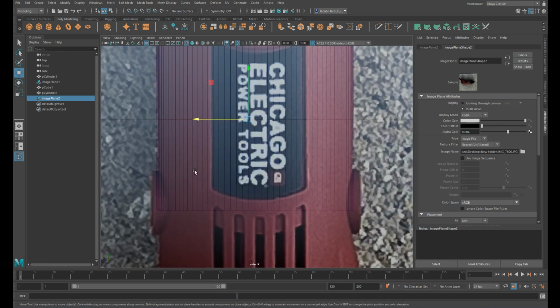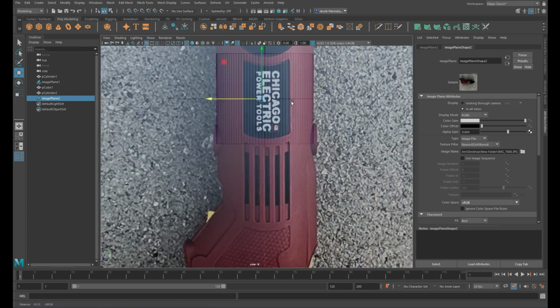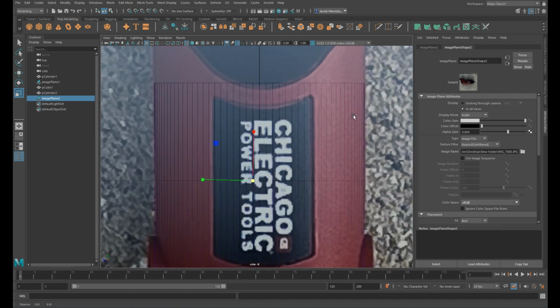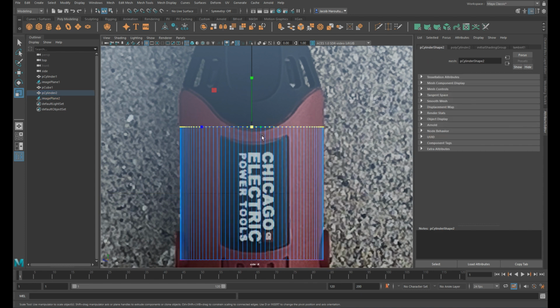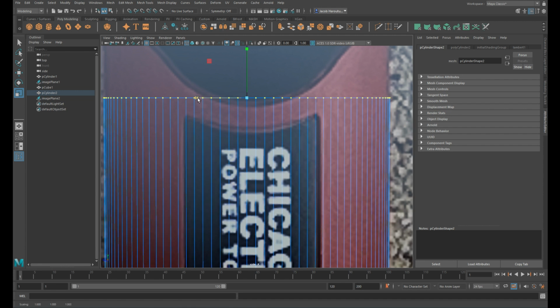All right, there you have it. So yeah, 52.6 is from here, and it gets thicker up front, so it's 53.6 there. So I'm going to make sure that back here it's at 52.6, and that's looking pretty good. And then it kind of increases in size on this side. And I'm just going to bring that out ever so slightly.